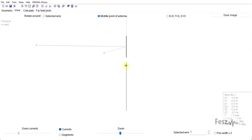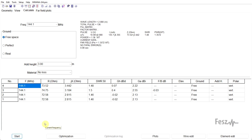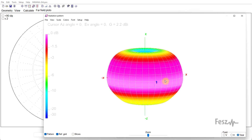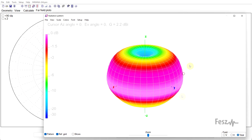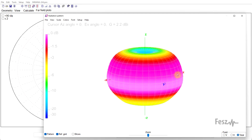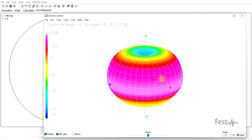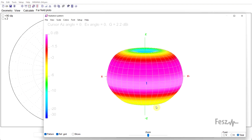If we come back to the simulator and place a conductive element in a collinear orientation with our original dipole — so our support structure is below now — and we recalculate, we do see a small variation in our parameters compared to our original standalone dipole. If we check the pattern, it's no longer a perfect donut, but it is uniform — whatever the deformation that occurred, it's the same in all directions. So this is the big advantage of the sleeve dipole: you can mount it vertically and get an omnidirectional pattern, not just in theory, but also with a practical build.